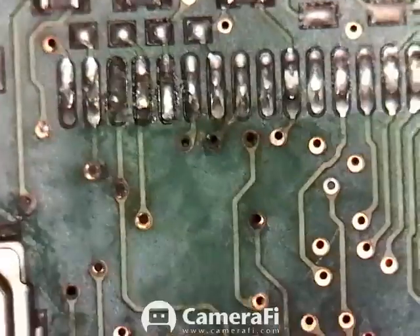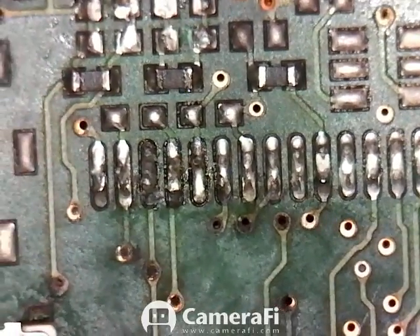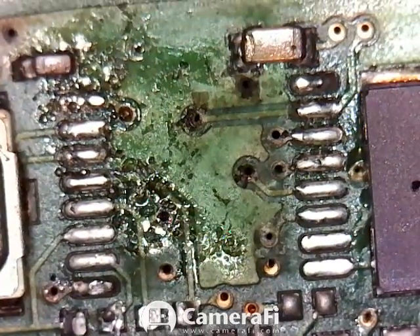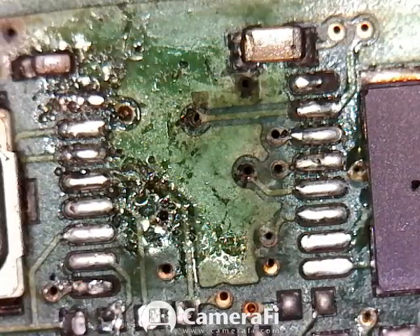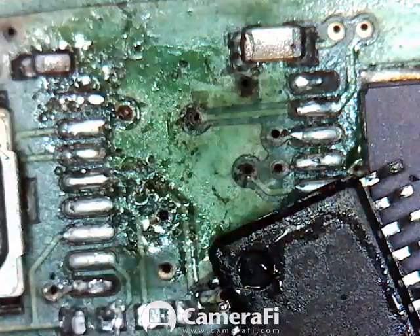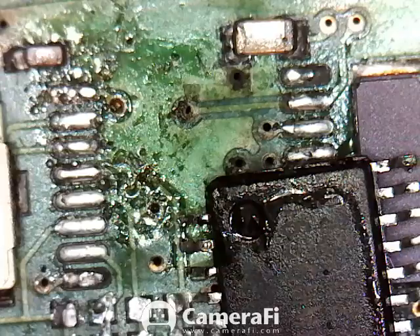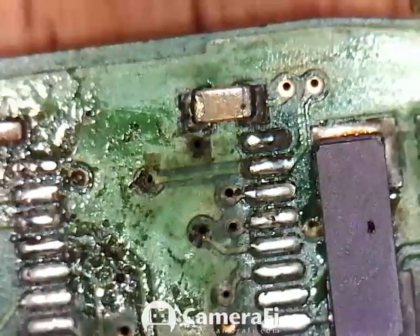Taken off of this spot right here on this frizzle-fried one that went in the salt water. These burns on these contacts had me suspicious if that IC was any good at all, because its neighbor over here managed to fry that leg entirely clean off — just got eaten up by electrolysis. You can see right there, it's missing a leg.